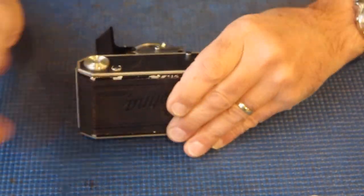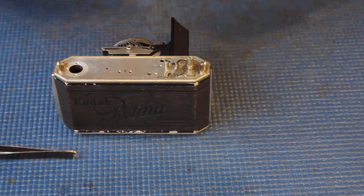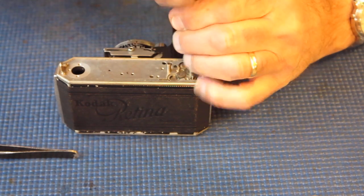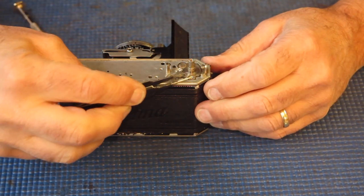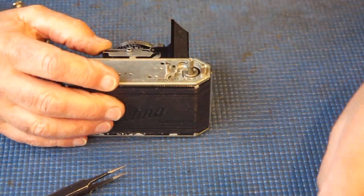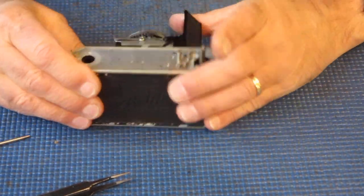I didn't see the spring from the base of this lever. I don't see it on the table so it probably means it's still jammed down in that hole — I'll have to retrieve that later. Three screws hold the bush at the top of the film advance shaft. So we've got a mixture: some screws loose, some screws tight. Here's the clutch assembly — I'll just split that. That goes through the cleaner, and that basically is the top of the camera.